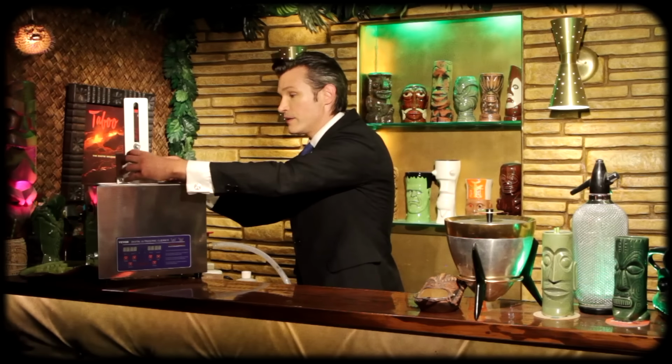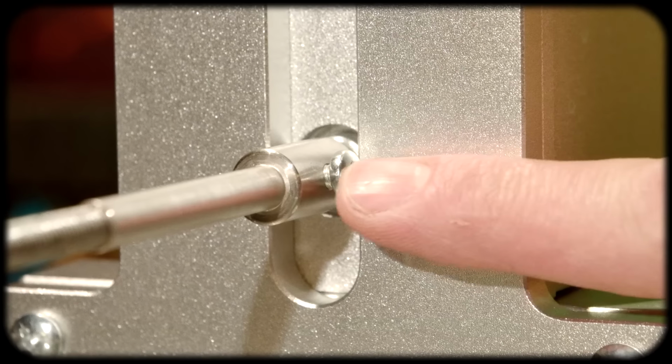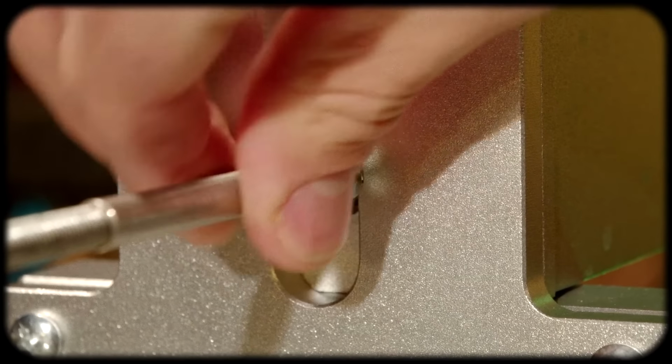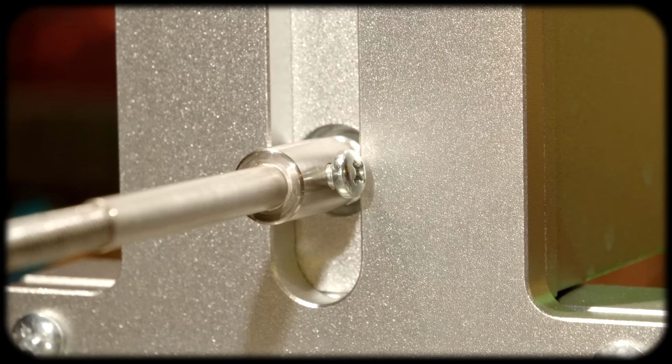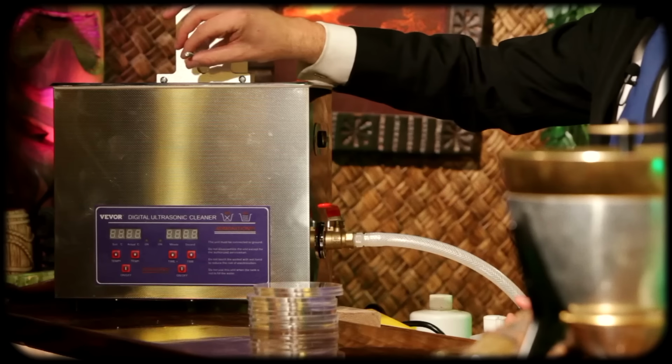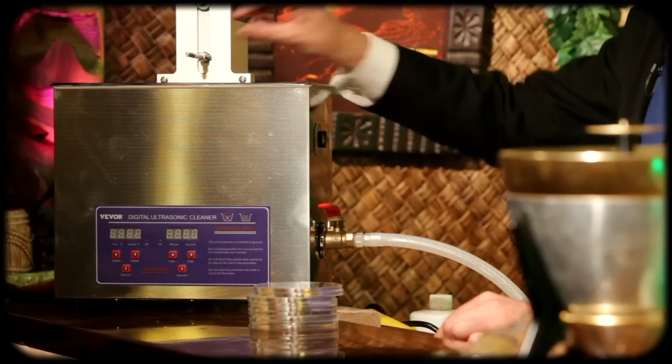And I think it's a simple fix, because if you slip these spacers off, you can see this is a smooth shaft up until they put the threading, right? And this just has a set screw here to attach to the motor spindle. Simple fix: leave this unthreaded, just have a smooth shank here, and then get something similar to that. Yeah, it's a little more inconvenient because you've got to get a screwdriver, but there's probably a way to get a thumb screw in there and they would eliminate any of those issues.